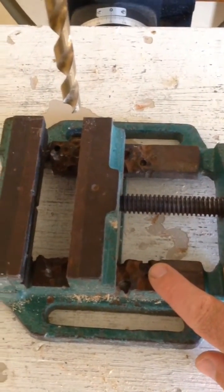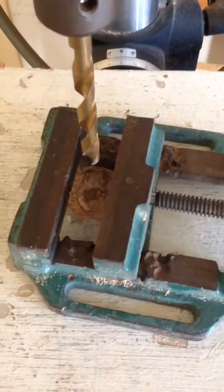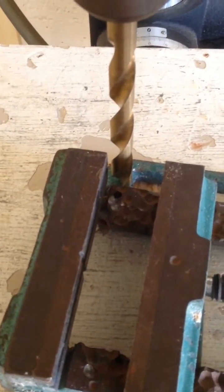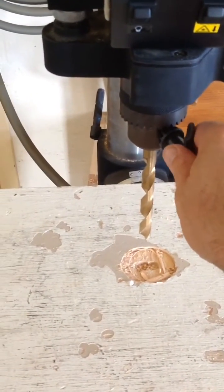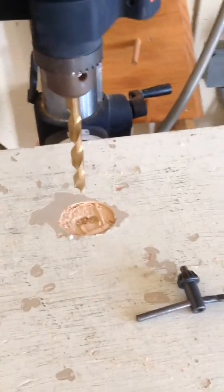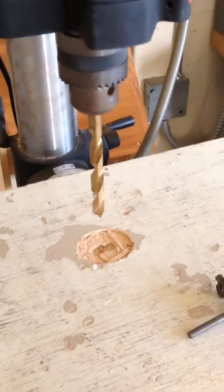As you can see, there's a lot of holes. Never drill into the metal vise. If you're going to use this vise to clamp your piece, align the bit so that it goes and misses the metal vise — don't put it directly under so that you drill into it, as it messes the vise and the bit up. Always pull out the chuck key; if you turn that machine on with it in, it's going to send it flying right at you. And always before you drill, adjust the depth stop so that the drill bit does not drill through the wood table.